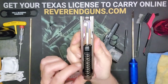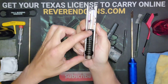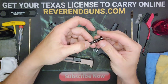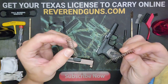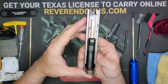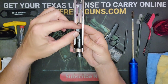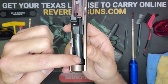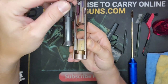With the frame, to take out the recoil spring guide rod, you press it towards the muzzle and lift up slightly, and that'll allow you to take it out. This is the guide rod and it has two springs in it — we'll clean both of those as well. To get the barrel out, push it forward a little bit so you can lift up the back. There's a little cutout, and the barrel is kind of bell-shaped; you just lift it up through there and take out the barrel.